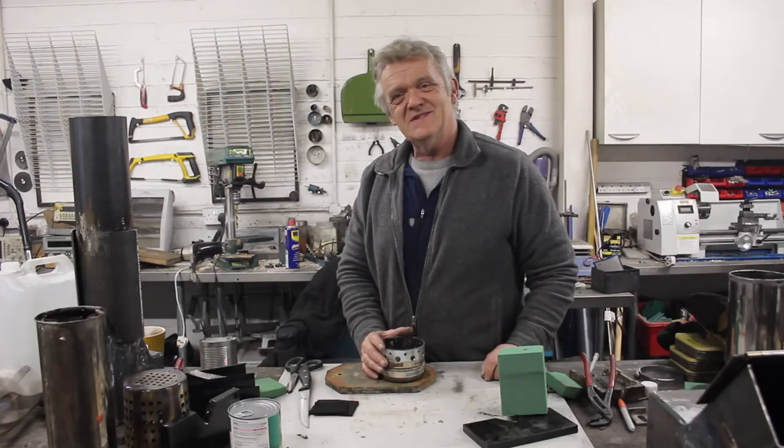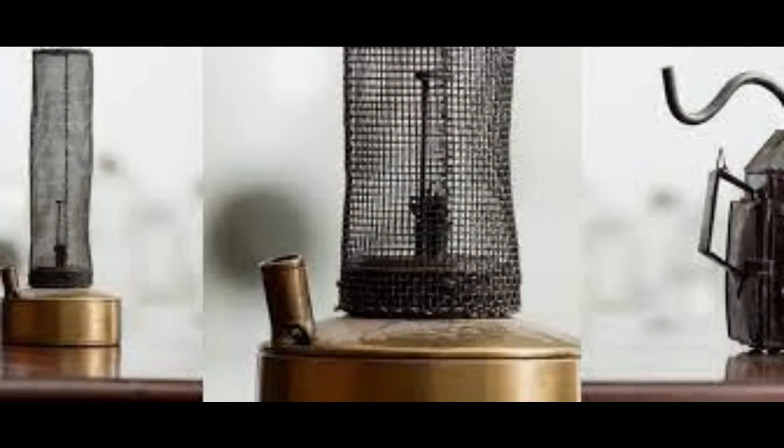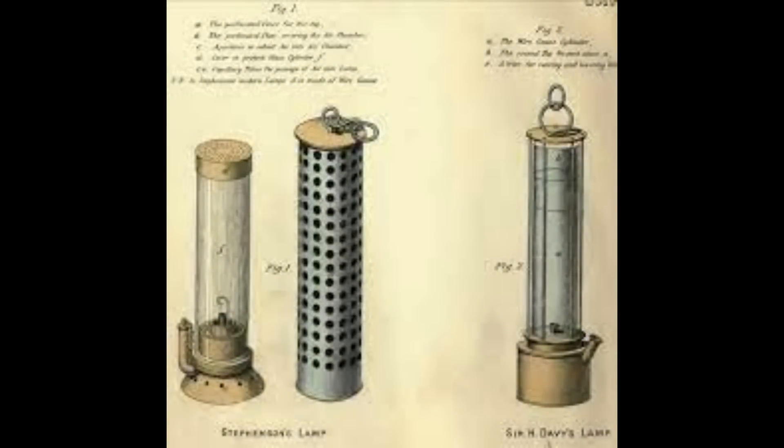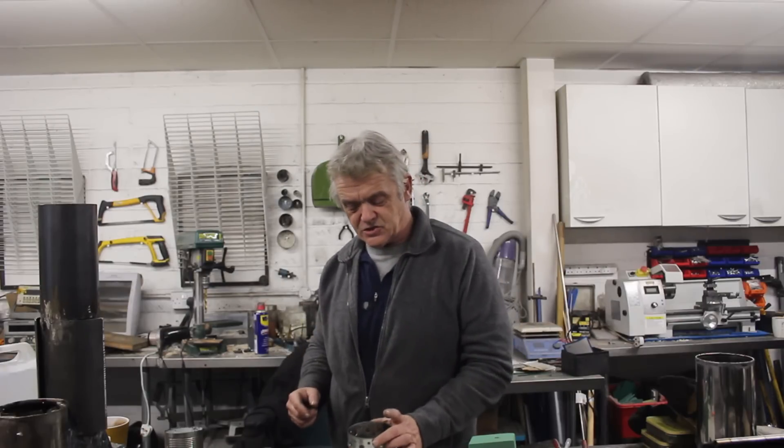This works because of the Davy lamp. The Davy lamp is just an ordinary open-flame lamp with a metal mesh around it. It works because gases can get in and out, but the flame can't pass through the mesh — so it acts as a flame arrester. We're doing the same thing here: when we light a little fire in here, the wire gets hot, which heats the fuel underneath, vaporizing it. The fuel gases pass through the steel mesh where there's heat, flame, and oxygen, so they burn — but the flame can't get back past the mesh.